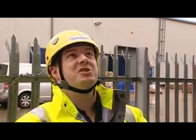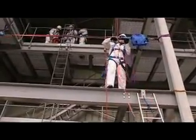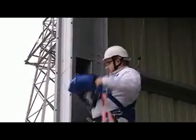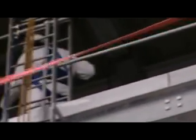To recap tensioning: pull the line up as much as you can by hand, holding the two big red pieces of webbing together so they're parallel. On the indicator, what you're looking for is literally no visible gap between the tooth and the flat bit underneath — no fresh air visible between them.